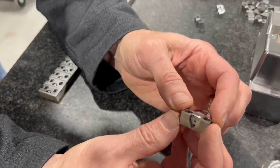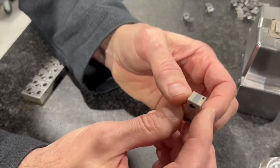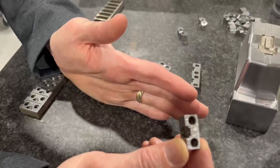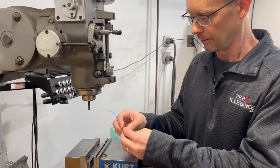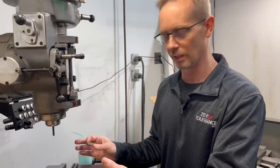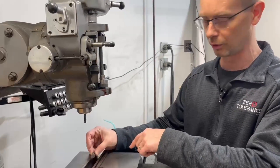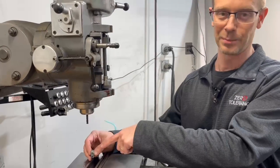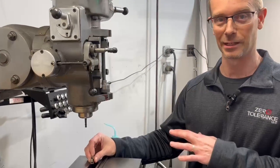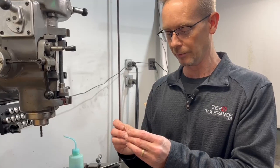This part's pretty simple. It's got a lot of little details and we have to cut it on all six sides. Normally we would take this block and square it on a vise. Even if you had to make five or ten of these inserts, you would get a larger piece, square it up, saw cut it off, and then mill it square. Make yourself a stop on the vise, drill the holes, set it up, drill and tap these tiny 2-56 holes. There are a lot of setups doing them individually or even in a bar. This is how we originally did them — it got us through, but I don't recommend doing it like this anymore.